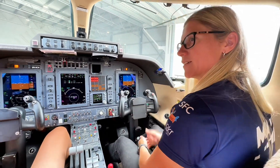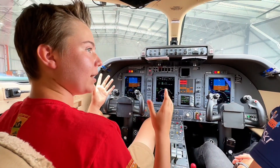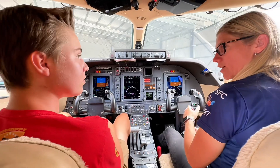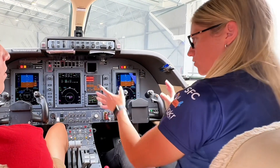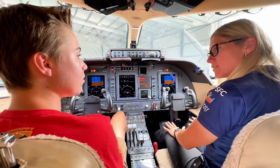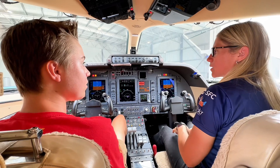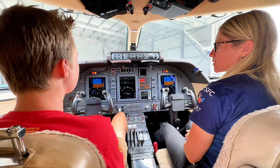So you can actually see where the hills are. When you turn on the battery or this switch, do you show up to all other airplanes that you're on the ground but turned on? Yeah, so our TCAS, our traffic advisory — we send out a signal as soon as we're turned on. But we're not going to be active because we've got our weight-on-wheel switch active, meaning we're still on the ground. It's not actually sending our position out until we take off. As soon as the wheels come off the ground, then it shows where our position is. But we can also see where everyone else is through this as well.